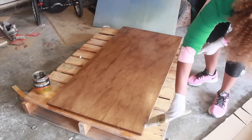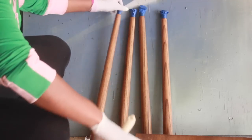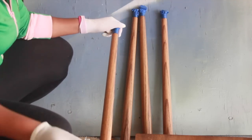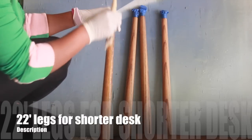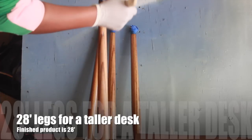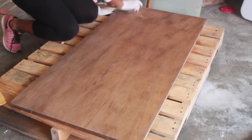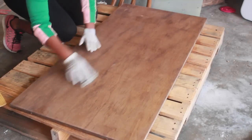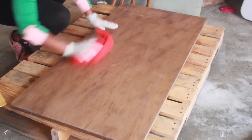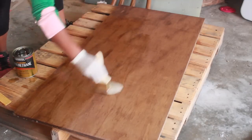I'm taking some of the polyurethane and adding it to the edges of the desk as well. You also want to tape off the legs. I got these legs from Waddell at Home Depot, or you can get them directly from Waddell — these are the 22-inch legs. I stained them and then I'm putting some poly on them as well. Once the first coat of poly has dried, go back in with your sanding block and give it another good sanding, then take a rag and wipe it off. This second coat is what makes it really shine and gloss — it's just perfection.